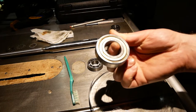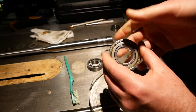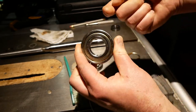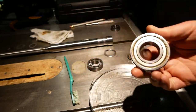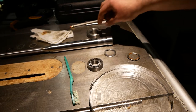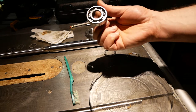This other bearing is the lower bearing on the quill, made by a company in Taiwan called TPI. I've bought their brand before and they're usually pretty decent. It's silky smooth — no crunchiness, perfectly good. Being a deep groove ball bearing there's a little lateral movement because it's a radial bearing, so the inner race moves slightly axially, but radially there is no movement. I could put that bearing back in and probably be fine, but I have a Timken 6206 2RS C3 bearing coming to replace it — a precision bearing rather than standard. Better bearing coming, and then I can put this quill assembly back together and eliminate all that crunchy sound from the top.